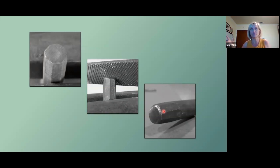I mean, it literally becomes a projectile, almost like a bullet at that point, entered into somebody's wrist, and they needed a tendon repair after that. So keep it clean. It's an easy thing to do. You can file it off or even do it on a belt grinder. And as long as you keep the tool from turning a color or getting too hot, you're not going to over stress that working end.